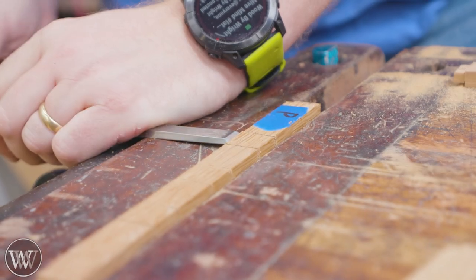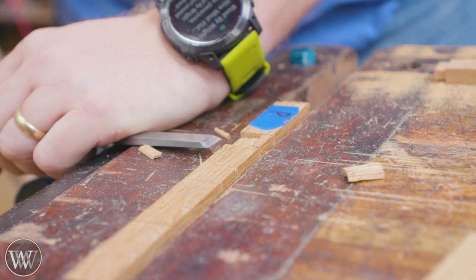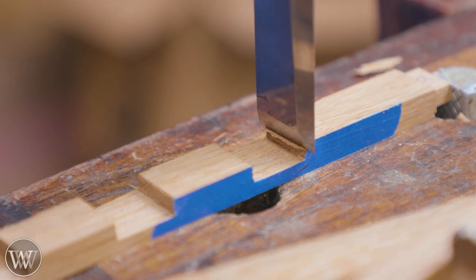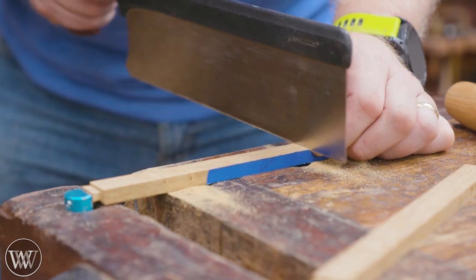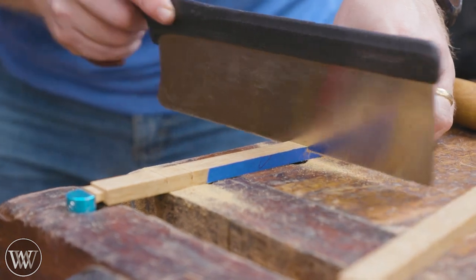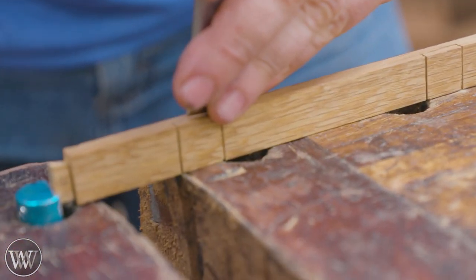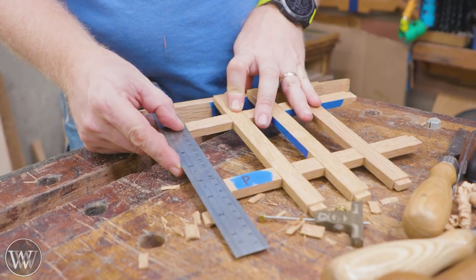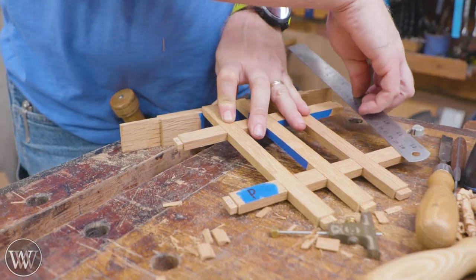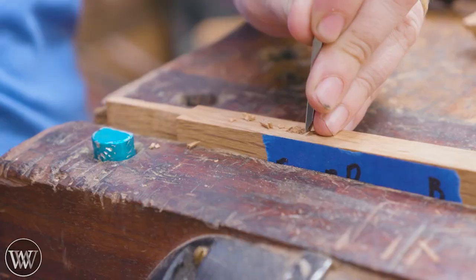All of these hash marks are going to be half-lapped together. There will be three that run vertical and two that run horizontal. You need to cut down halfway and then remove the waste in between. If I'm going too fast here, I do have detailed videos on every step — there is a series of four other videos and I'll leave links in the description. Once we get these all cut out, we want to make sure they just pop together and have a nice tight fit. This will create a simple hash work that then fits between the stretcher above and below, and then the legs in front and in back.